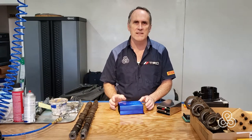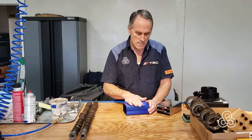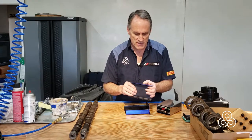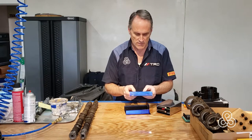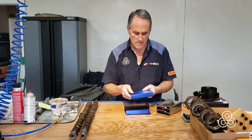So I thought I would change that to a nice blue to match the car, but we had some failures learning a few things about powder coating. I got this color called intense blue — it gets its intensity by being a translucent blue that goes over a chrome finish. I thought I would bypass a step because once I sanded the anodizing off I had a nice polished shiny aluminum look, sanded to 400 grit, thinking the blue would use the aluminum as the reflective coating. But two things happened — first, I could see the sand marks, as the intense blue with the translucence just magnified the scratch lines.